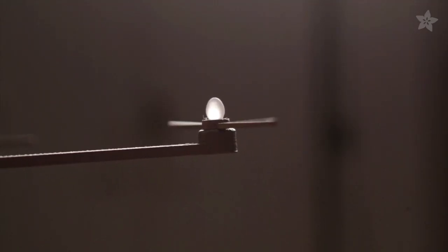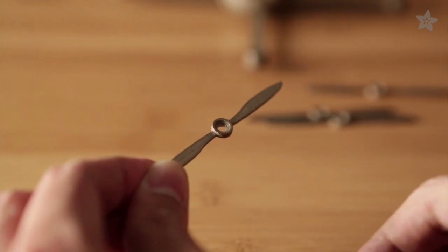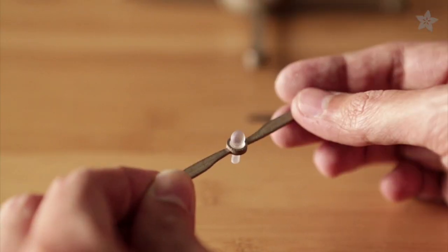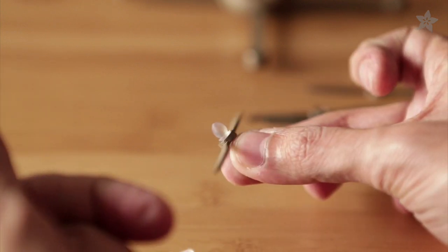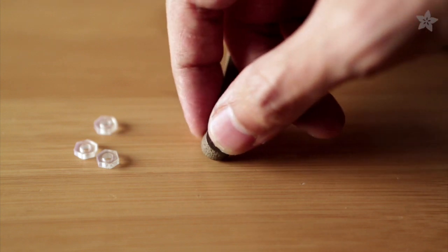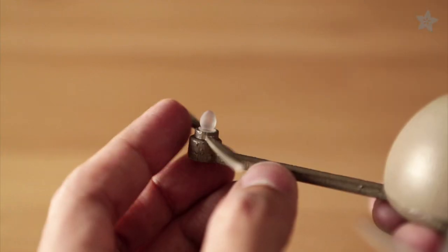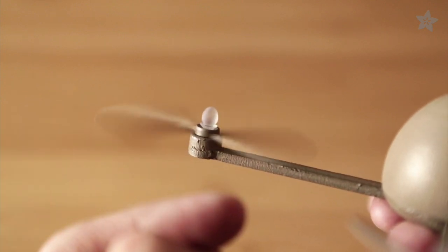For the propellers, we wanted them to actually spin, so I had to design it in several parts. The prop piece has a hole in the middle, so a studding can be inserted and held in place with the lock nut. The studding piece itself has a cool little cap on top, which really finishes it off. There's a cavity on the bottom of the prop arm for the lock nut to snap into, and we'll just glue it in place. And that's pretty much how we made the props freely spin.